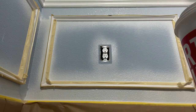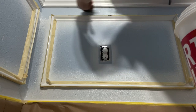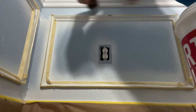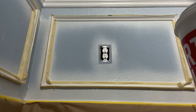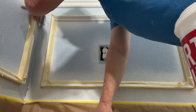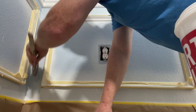Nice finish. Okay. Now, I'm going ahead and putting a second layer on this. Nice and thick. Because here's why. It's a textured surface, and I don't want bald spots. You'll notice with finest paints, this will happen too. When your paint settles down and starts to dry, you'll see that it was completely blue, but there were speckles of white. The reason being that when the paint settles, it's literally settling over this texture and pulling away just a bit.